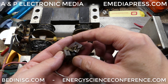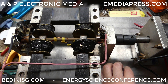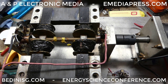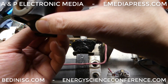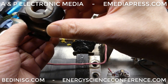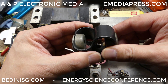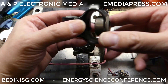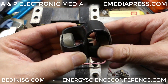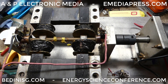As this thing was getting moved around and crated, one of these brushes broke off, which is not a big deal — it just needs to be put back. The original coupler here is a Kushnet company coupler; they don't exist anymore but you can find them. This was used in case the drive shaft and the generator are not perfectly in alignment — it gives a little bit of free play. It's kind of old and hardened, so I'd like to replace it. For now I've got this Lovejoy coupler rigged up and we do have pretty good alignment.